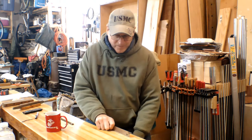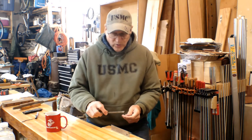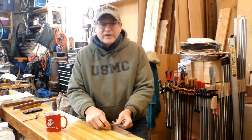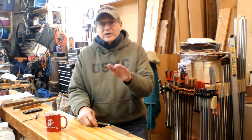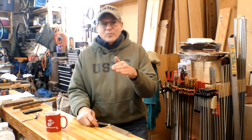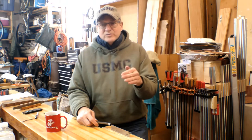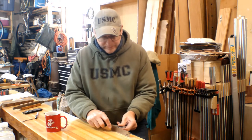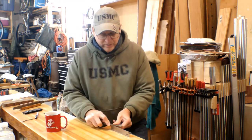I use a bench vise. Lock it in — make sure you lock it in really good because you're going to be putting some pressure on this. All you do is take the file and hold it 90 degrees to the face, parallel to the edge of the face. The objective is two-fold: one, to get rid of the crown — when you burnish it you create a little crown, so you're flattening that out and you want the top perfectly flat; the other reason is you're getting rid of the work-hardened material on top so that you can turn a fresh burr. You can feel it catch and release, catch and release, until you have a nice cut all the way across.